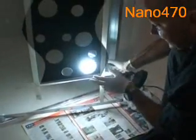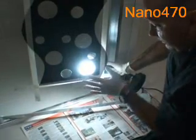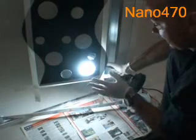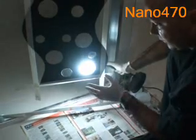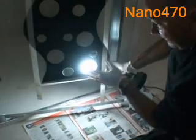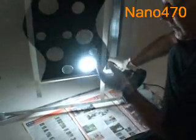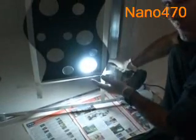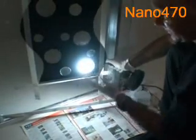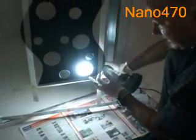Now this curing process takes about 30 seconds. Do not move it during that period of time. So with a watch or counting in your mind, just count to 30 and that bevel should be bonded. If it's not, you might need to extend it out to 40 seconds. If the temperature is low, it's cool, it's cold, it takes a little bit longer for the adhesive to cure.